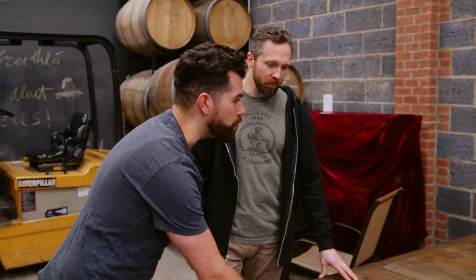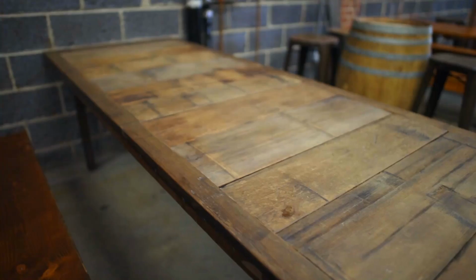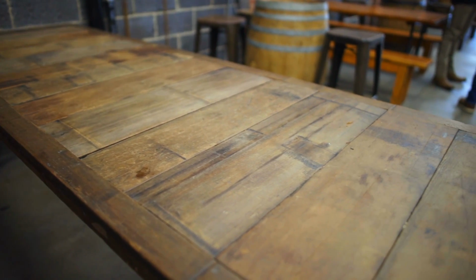Now speaking about finishes, I know at the start you probably didn't use sweat and beer and oils to finish it. How do you finish something like this that you know is going to be going into a space that's going to be used every single day? I know it's a lot different than just doing a dining room table at somebody's house, for commercial stuff. So what kind of finish did you use on this? Seeing as it had an existing patina on it, we sanded this down with 100 grit and then 220 and left it. And then what you see here is just from the use of the wood. So this is the natural patina of the wood. Nice. So you just water popped it and then let nature take its course, I guess. Exactly. All right, I love it.